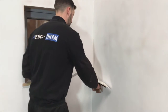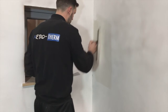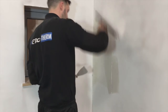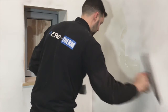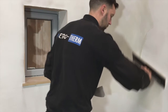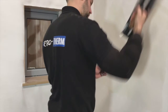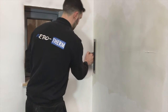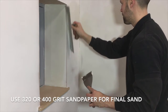To achieve a consistent smooth surface, a compatible filler can be used to fill in any remaining indentations or pinholes. It is possible to use Aerotherm again but as it is water based it may shrink back slightly. You can either choose to spot fill or go over the whole area and scrape back any excess. Either way, ensure you closely check over the whole area. Creating a smooth flat substrate, applying the base coat as per the preparation guidelines, and ensuring Aerotherm is properly mixed with no air infiltration will greatly reduce the amount of filling required. Once complete, you can then quickly go over the whole area again with fine finishing paper.